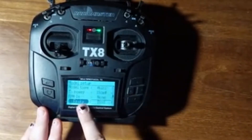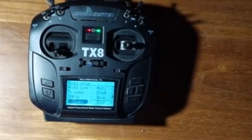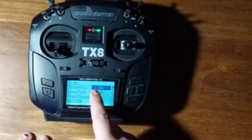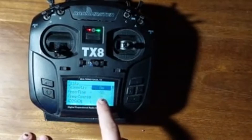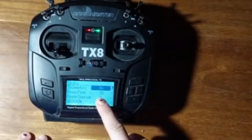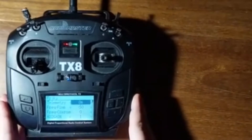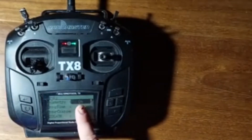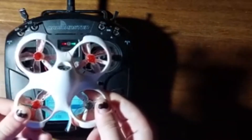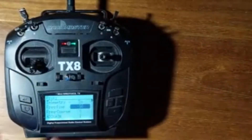What you're going to want to do is go straight to FRSky and select FRSky in your receiver options. Click FRSky, and then you don't need to mess with any of this stuff except for the frequency fine — set that to negative 50. That will put it in D8 mode, because this is a deviation controller, not an OpenTX controller. The Cetus FPV drone has a D8 receiver in it, so you need D8 mode, which is negative 50.